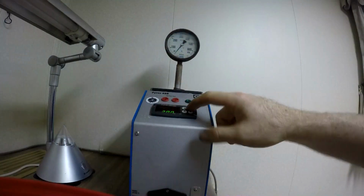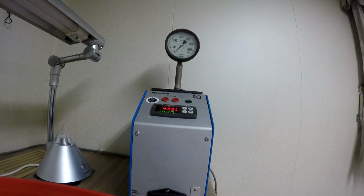Checking the exhaust gas temperatures of any cylinder is the best way to start, the easy way. And that I want you always to have in mind: you must first of all see the easy way how you can solve a problem, and then move on to the next step.